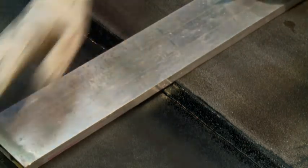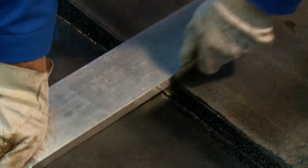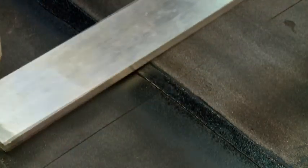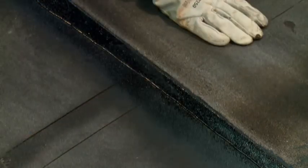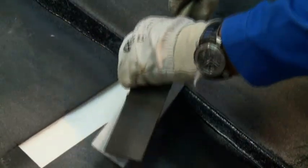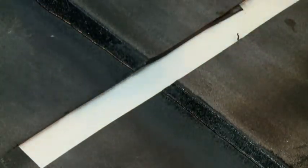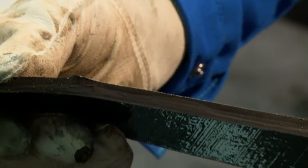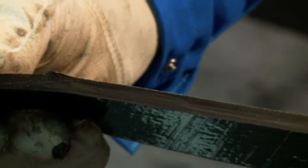A cross-section of the weld is investigated by cutting a perpendicular sample piece across the joint. The size of the cut should be 15 to 20 cm and it should be avoided being taken from sensitive areas. Check that the overlap, including the two layers, is fully welded without any empty space.